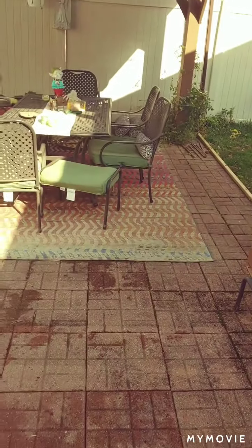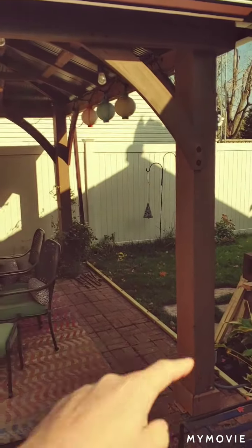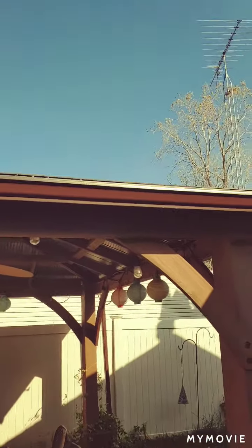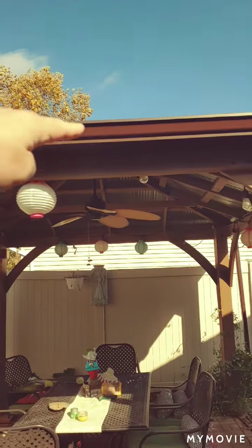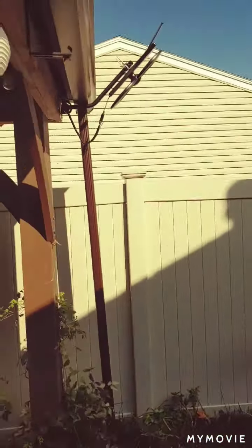I get an ice rink here and over there because that roof is not into the grass. As for the gutter, there's not enough fascia to attach the gutter to — that is not the fascia, just a little itty bitty fascia here. My original intent was to slope it down this way and then back here, discharge the water, and keep the ugly downspout out of the way.